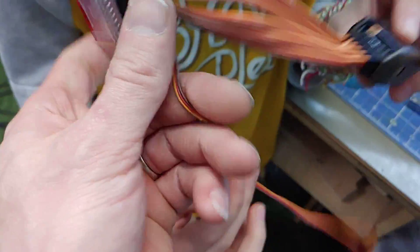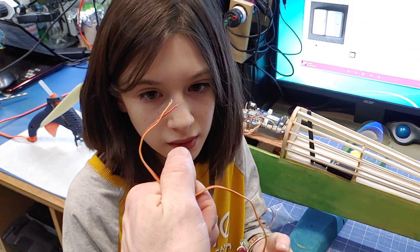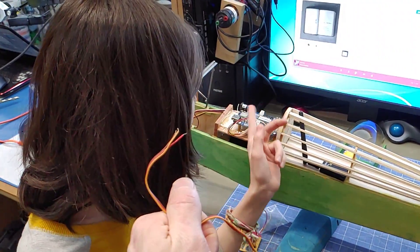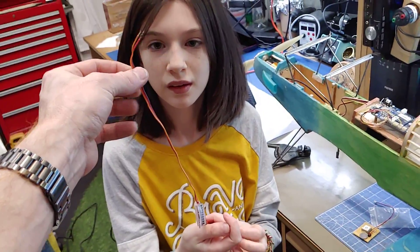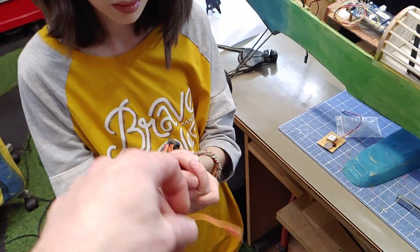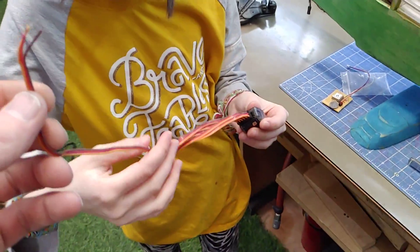So we're gonna connect this wire here to the oscilloscope and make sure it is 3.3 volt output. So this is the only wire that goes to our controller — it just talks to that and then sends all the data in one wire instead of sending it through all these wires. Is that supposed to be easier? Yep. Wow.